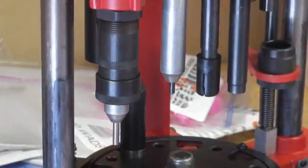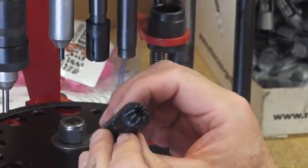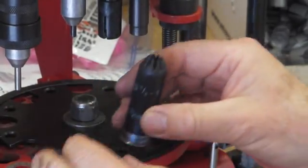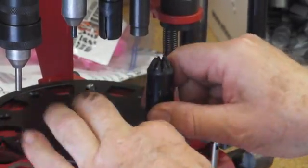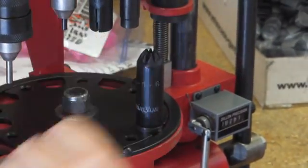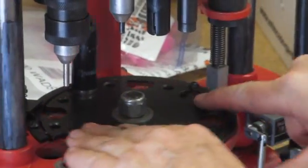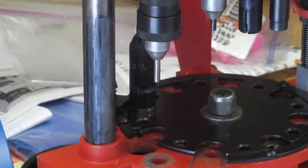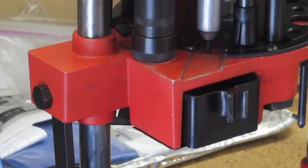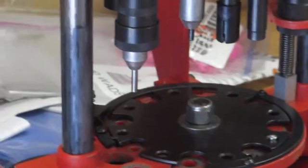so there's pre-crimp, and it's a little bit smaller than a pencil, but you can see it's all started to fold over. And then it goes back to, oh, what is that? Oh no, not another primer. Now we're at the crimp station itself, and that'll take the folds and push them down. And that gives us a pretty good looking crimp.